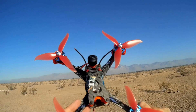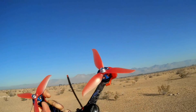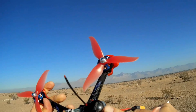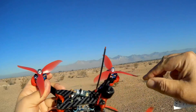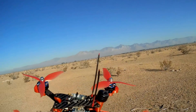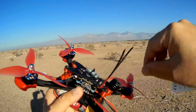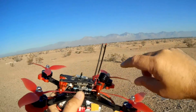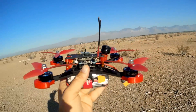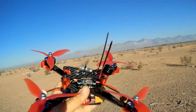Notice this RPSMA antenna stuck in here — right-hand circular polarized. This is a nifty little antenna. What I like about this design is it has an RPSMA connector inside here, but this antenna sits down nice and snug and close, less likely to get damaged in a crash. I think that was their idea with this type of design for that antenna.